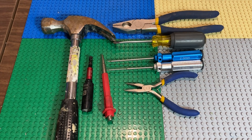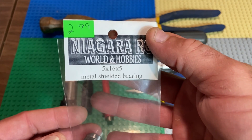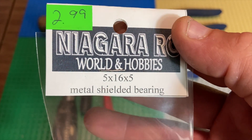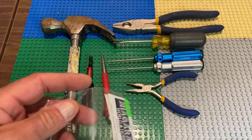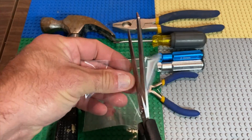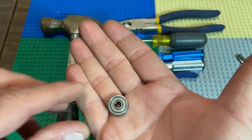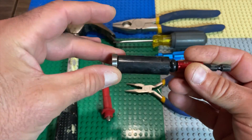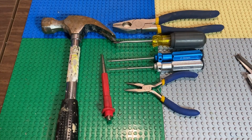The tools we need today are pretty common, except for the tapered punch and a 12mm socket with an impact driver or extension — that's what we'll use to push in the bearing. I buy most of my stuff from Niagara RC in the Niagara region. The bearing is 5x16x5mm, and we're using metal bearings today, no rubber shields. You want a socket that matches up with the outside race of that bearing.